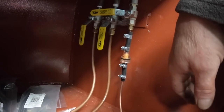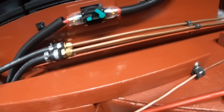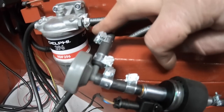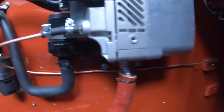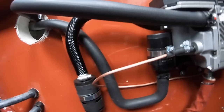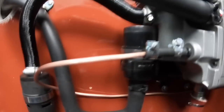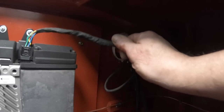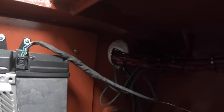So that's a fuel line fitted, so isolation valve, fuel filter, runs along the top of the counterplate and then into the fuel pump just there. Straight out of the fuel pump, comes round, probably not able to see that very well, but comes round the back of the battery, side of the battery tray, clipped all the way around the boat there, and then it just continues to rise all the way along there, up, and then there's just a nice sweeping bend rather than tight bends going into the heater. Got to be clipped up again, another clip to go in there, and all those cables from the wiring loom from the heater, they're all going to be tidied up and put out of the way.